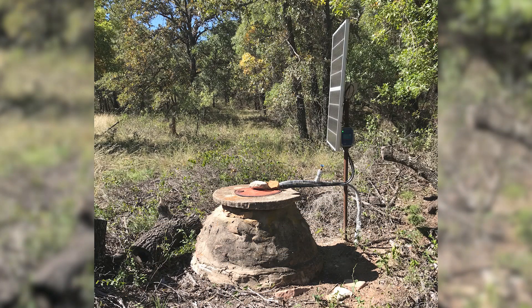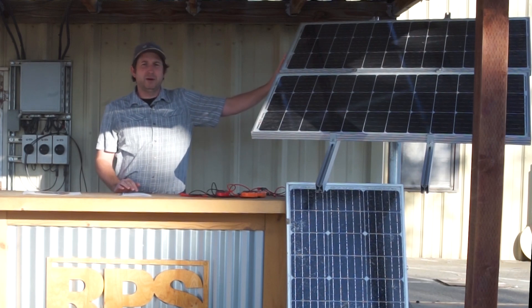Here's a picture of a customer who was having lower water production. As you can see, it's a very steep angle. We had them adjust it to the right tilt angle based on their latitude and they significantly increased their water production. This mount is currently set up for summer and we need to make it a little steeper. If you have one of our top-of-pole adjustable mounts, this adjustment is simple — you can make it two to four times a year to maximize water production.